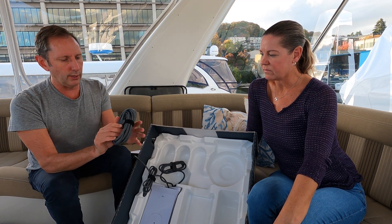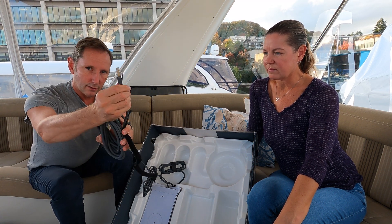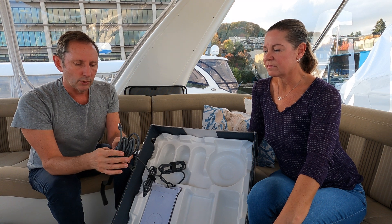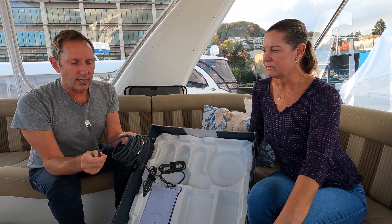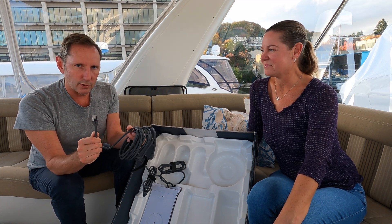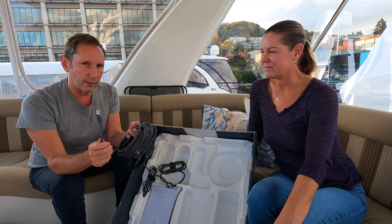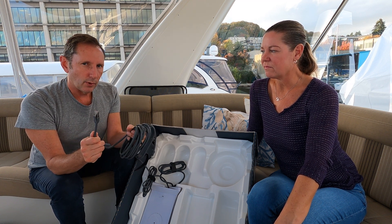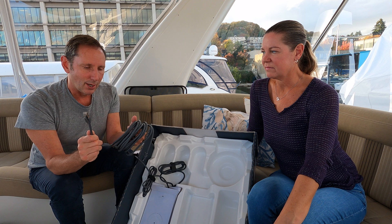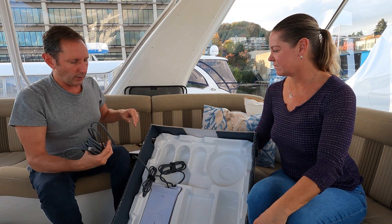This particular cord is a standard RJ45 — it can go directly into your modem. We're actually going to have a standard RV Starlink that doesn't support mobility and this in-motion one, so we're covered in both scenarios. We can bond them together — they call it WAN smoothing — so if one hiccups the other carries on, preventing dropped calls. That's why we're putting two of these in. It's cool that this RJ45 cord means we can basically get rid of the included modem right off the bat.